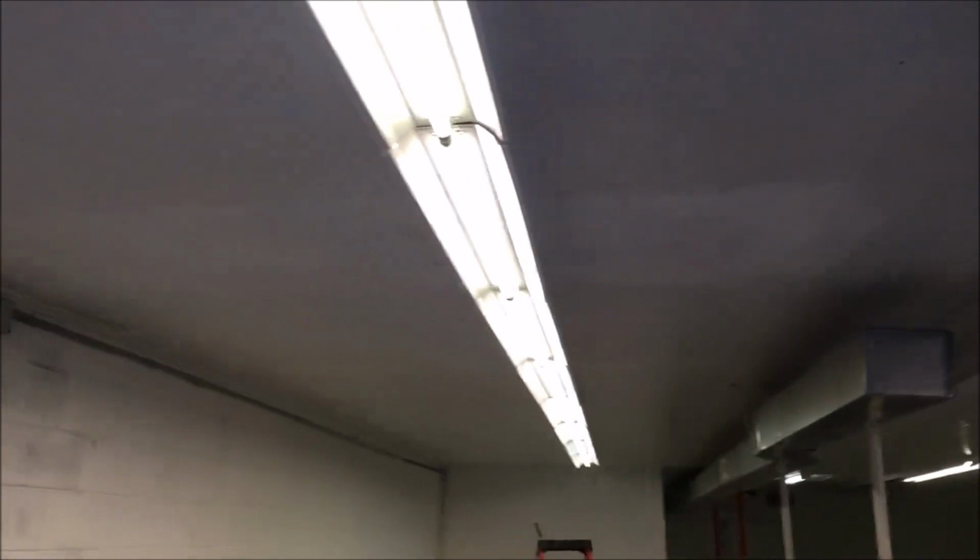Okay, y'all, I got up there and I sanded that patch before we put that big spot in there. We had the electrician put a new light in on the front. But I sanded it to knock down the ridges enough, and hell, it blends in. Can't tell it really. I can tell it because it's a slightly different color since I ain't painted the whole ceiling, but it's close enough, I believe.